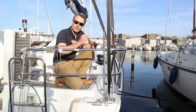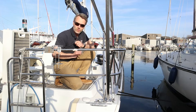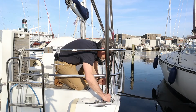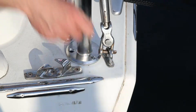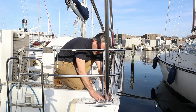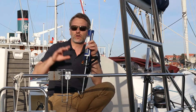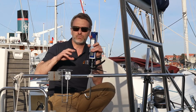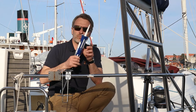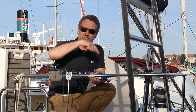As a final check we insert all the bolts just to confirm that they properly go into the holes. Before making the final placement of the arch down onto the deck and bolting it down, we're going to apply some marine grade sealant on the deck just along the edge of the foot.